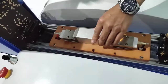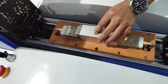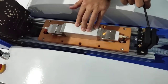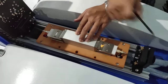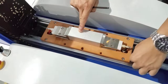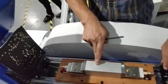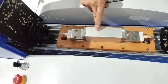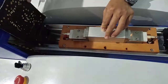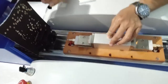This is step 2. Now we are going to step 3 to adjust the laser beam quality. The principle: we should adjust these two stands — the rear stand. The rear stand is a 100% reflection mirror. The front one is a 50% reflection mirror. Each of the stands has two screws. By adjusting these two screws you adjust the mirror position — that means you are adjusting the beam quality — until the laser beam is a full 100% circle.